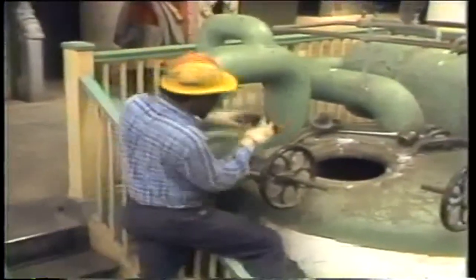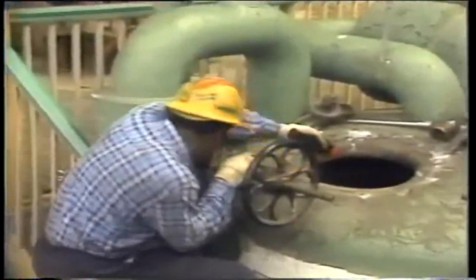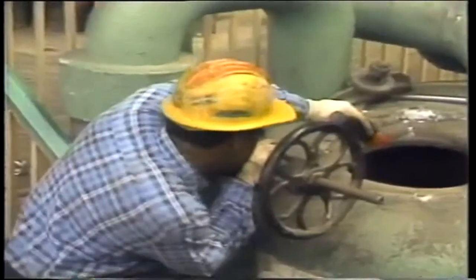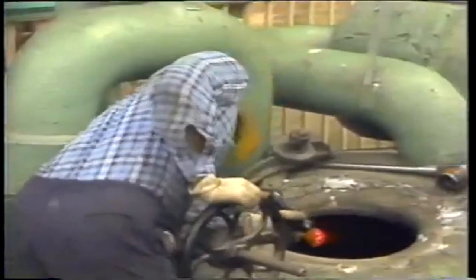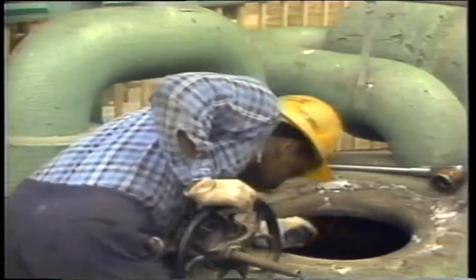With direct contact heat exchangers, you're usually looking for corrosion and scale and some of the problems they'll cause. This might be blockage of inlet nozzles, or loose scale might get into clean feed water as it leaves the heat exchanger. Maintenance on direct contact heaters is usually nothing but rewelding or replacing trays and tray supports. Since this is about all you'll ever need to worry about with direct contact heat exchangers, we'll limit our discussion in this unit to maintenance of surface heat exchangers.